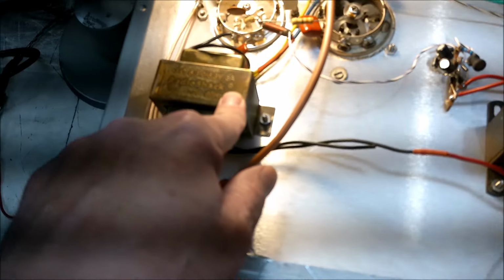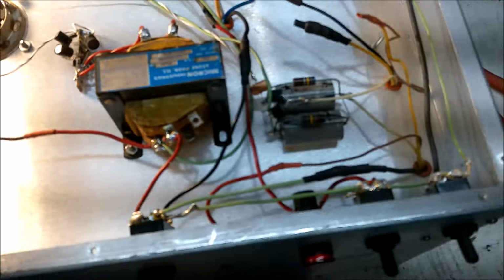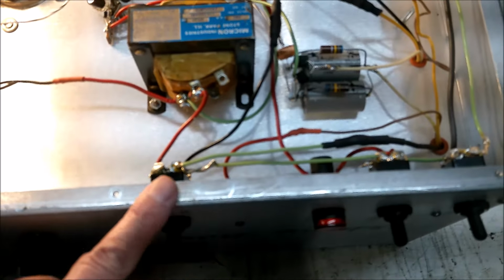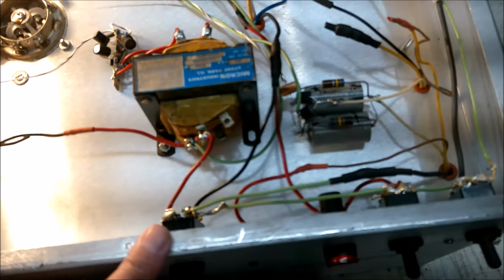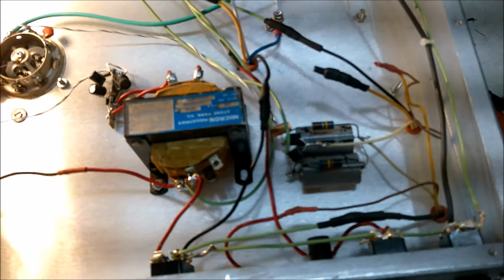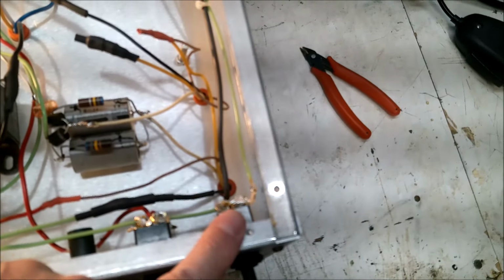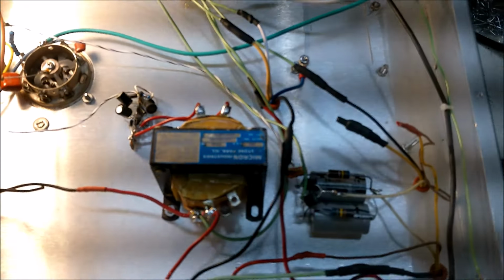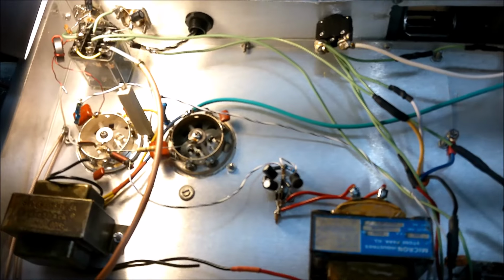that's a 6-volt filament transformer made by Radio Shack. It was actually set to where it would only turn on when you turn on the high voltage. Yeah, that was stupid. So we're gonna wire this direct to the power switch. So when you turn the power on, the filaments will warm up and you don't have to have the high voltage on at the same time. So